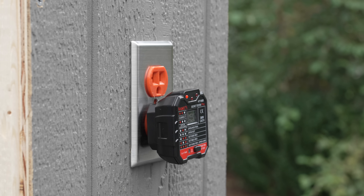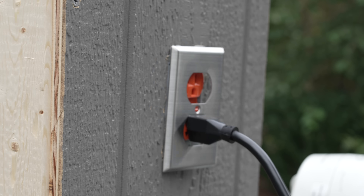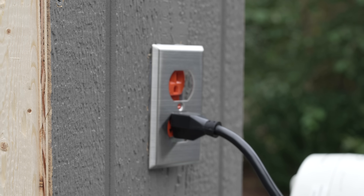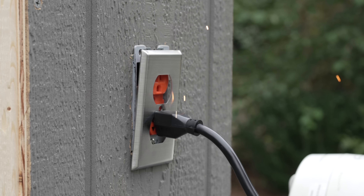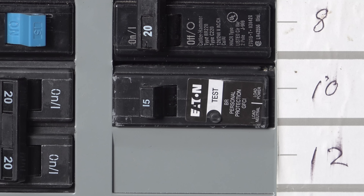So let's do a real test to see exactly what happens by putting the ground outlet upward versus downward. First, let's start off with the standard electric outlet setup. I've removed that center screw in the middle and as you can see, I have a stainless steel wall plate that is completely conductive. Both of those prongs are level, so as soon as the plate falls, it has no problem creating the short circuit, allowing the circuit breaker to interrupt the connection and provide a safe situation.